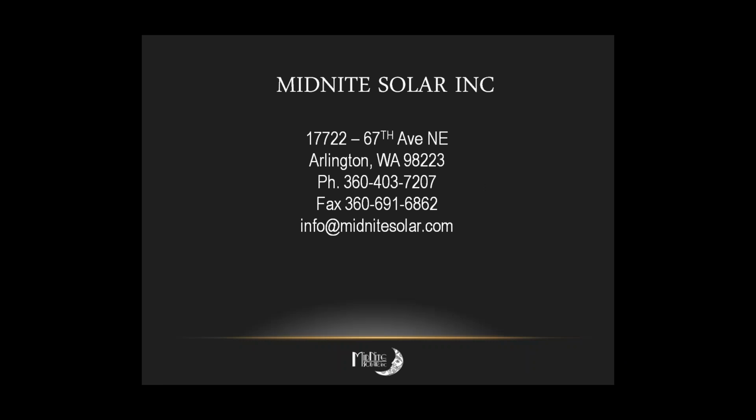I got a question. Sure, please do. When you're using these sealed AGM batteries, do you actually use the equalize mode, or will those batteries kind of equalize themselves? Well, the interesting thing is some AGM manufacturers recommend equalization and others do not. I'm not entirely sure on the Full River, but some AGMs can be equalized, and that's fine. As far as for equalizing themselves, I don't know of too many batteries that are good at playing with other batteries for any length of time. So I would keep an eye on that.